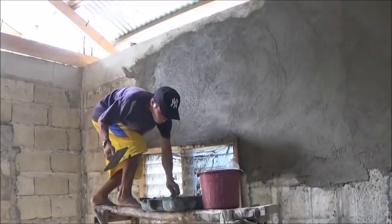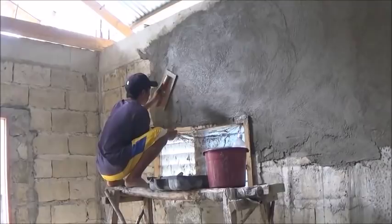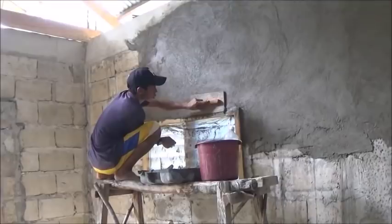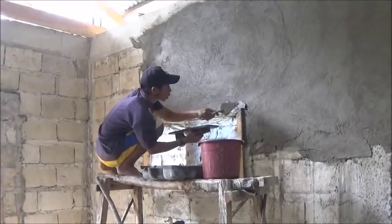When you wash it, the dirt just goes right into the pores of the cement. But if you paint it after you do the smooth rendering, you really can't tell it from tile — at least in my experience. That's probably what we'll do here. It's up to the boss lady whether we're going to do a smooth coat on top of this and paint it, or just paint it the way that it is.